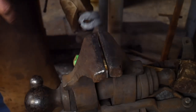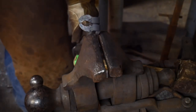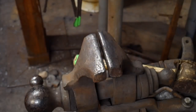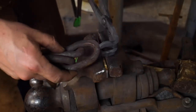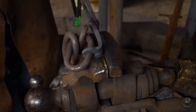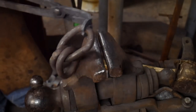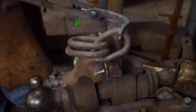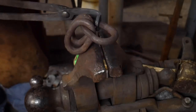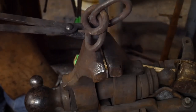And there you have it. There's a little bit of shifting here — we'll have to adjust those just a bit. But at this stage, we should be able to grip chain links from any direction we desire and have the links hang free and clear on the back end. So now we can have a length of chain, grip this anywhere on here, make our weld — just go like that, bring that chain right around, and now you can get your weld in there. This will also help with reach issues at the anvil.